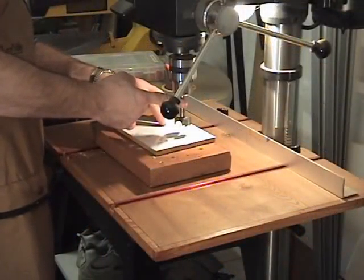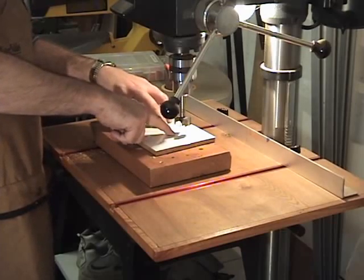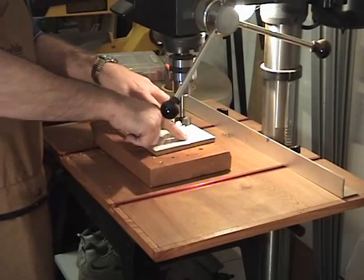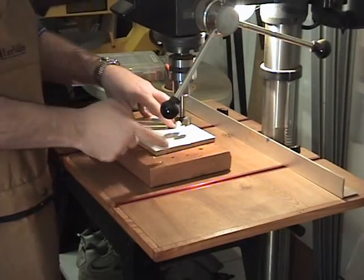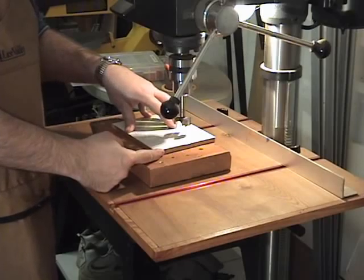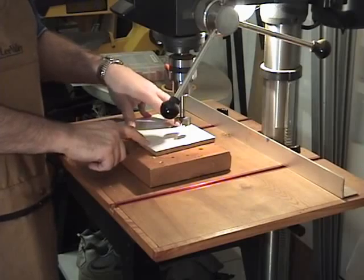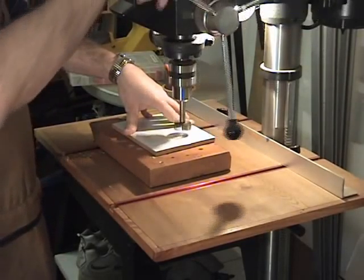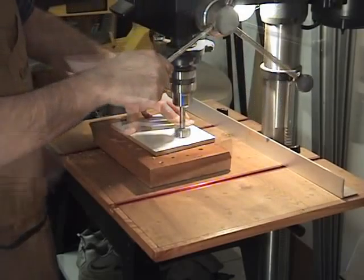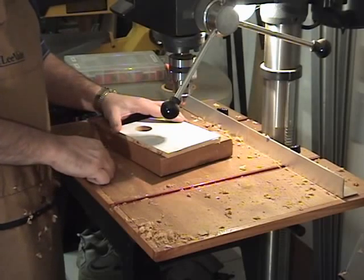This time it's going to be a little different from just drilling all the entry holes — we have to drill the hole for the clock insert. To do that job, we're going to use the Forstner bit. I've chucked up our 1 and 3/8 inch Forstner bit and carefully centered it over the opening for the clock insert. If I were using half-inch wood, I would probably not drill all the way through. In this case, with the 3/8 inch piece, I'll go ahead and take it all the way through.